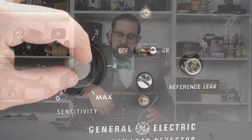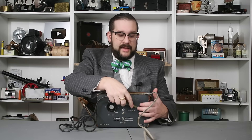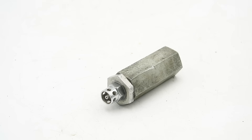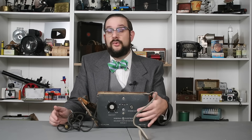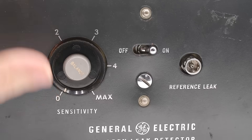The next step is to balance and calibrate the circuit. With the unit turned on, you turn the balance knob until the signal just stops. Then you take your probe and put it up against the reference leak — a little aluminum bottle filled with half an ounce or 14 grams of R11 refrigerant, with a calibrated orifice that allows the refrigerant to leak out at a rate of 14 grams — a whole bottle — every year. With the probe held up against the orifice, you then tune the sensitivity knob until you just hear the signal. The sensitivity of the detection element decreases over the lifetime of the unit, meaning you continuously have to increase the sensitivity of the amplifier.